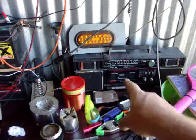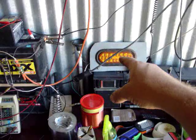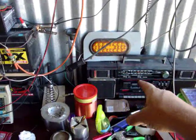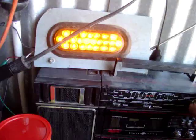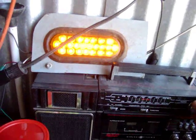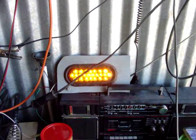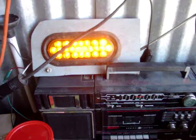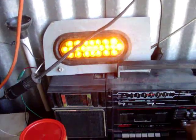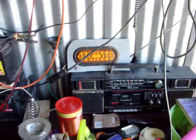A couple things to show you here in the meantime. This radio here is a nine-volt radio on a 12-volt system. A 12-volt LED directional light — a guy uses it on low power, brings it down to four volts when putting it in series. See the light blinking? Every time it uses power, the light gets brighter — there's a current going through it, it's in series. When I shut it off, no current going into the radio, so it shuts it off automatically.